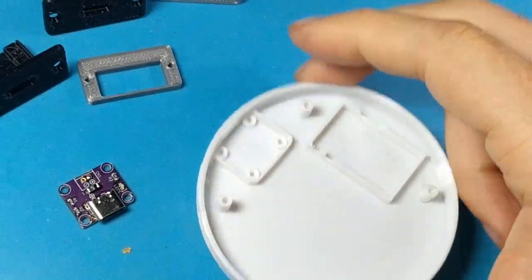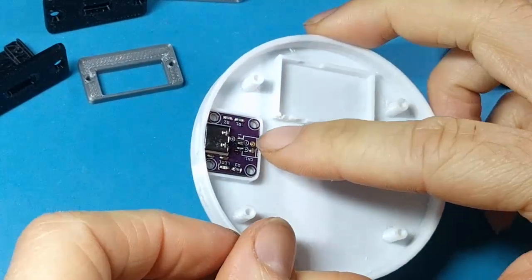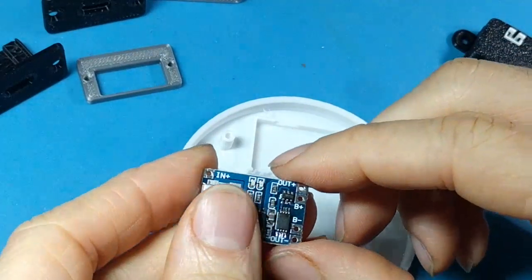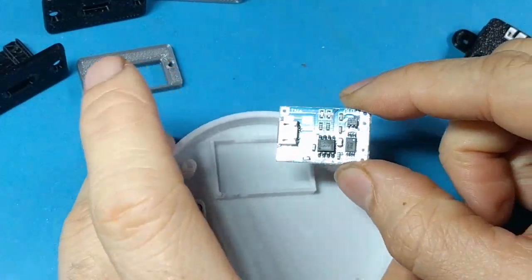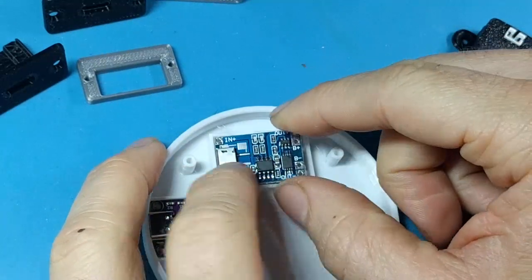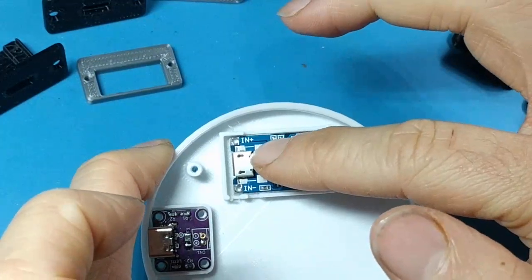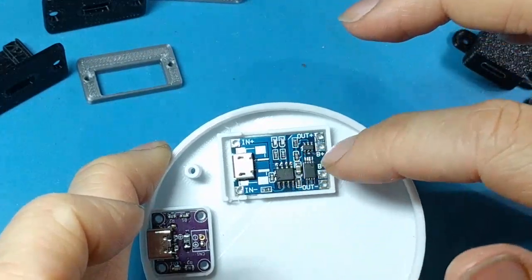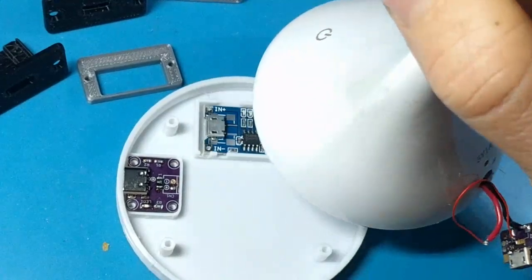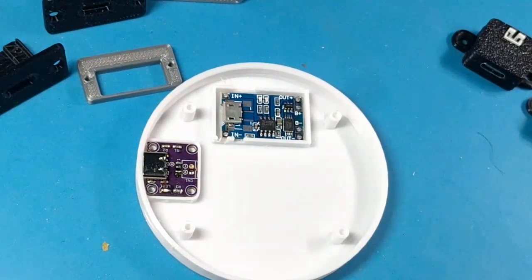What's also pretty cool is I've designed it to fit my USB-C board, which goes in just like so — all nice. Isn't it great being able to model and make your own stuff? There are four screws that'll hold that in. Additionally, I've got one of these TP4056 charger boards — these are really common lithium-ion charger boards with protection circuitry, which is the kind of charger I think is lacking in the original lamp. This fits right in here. I gave it a little too much room because I was borrowing someone else's model for sizing, and their model had the USB sticking out a little further. But no biggie — it's good enough. That'll replace what I think might just be a diode they're using to charge the battery. It'll make a nice legitimate charger, fit all nicely in the bottom, with even room to spare if I want to add other stuff.